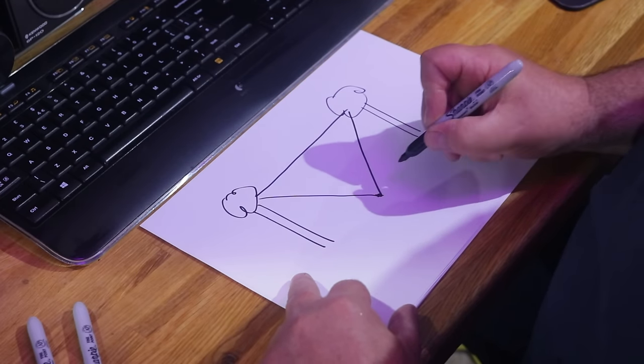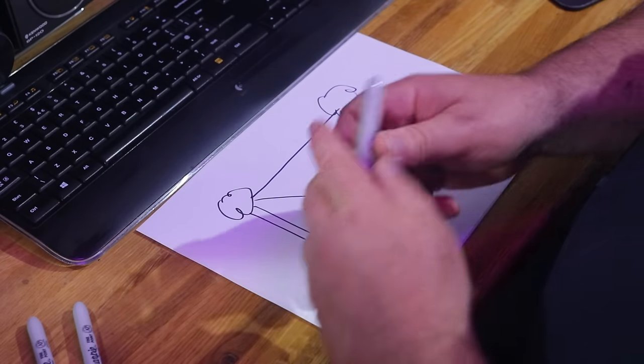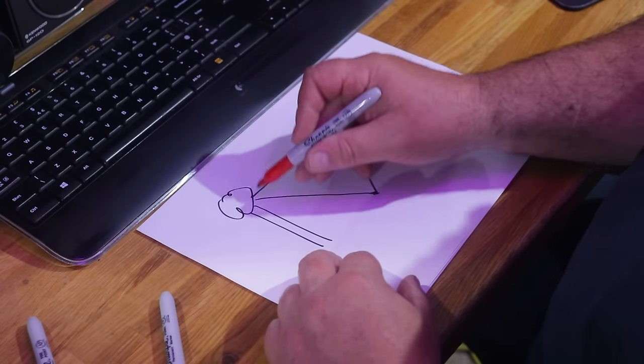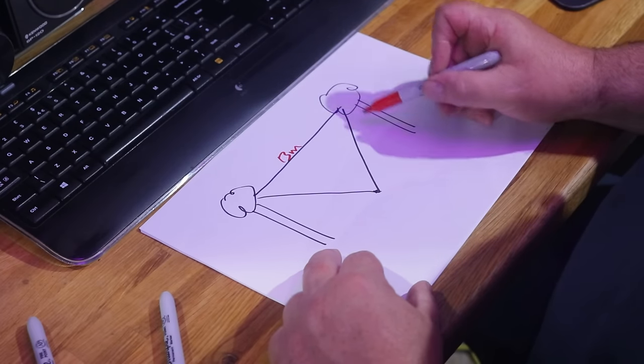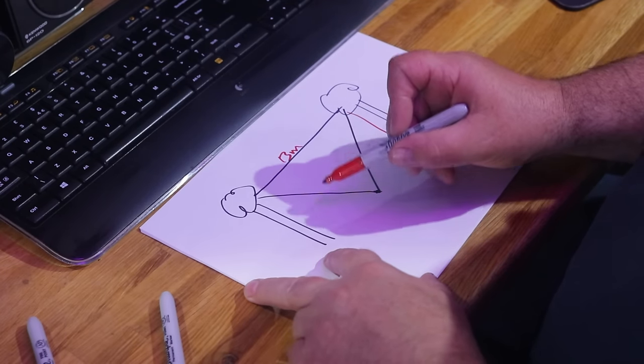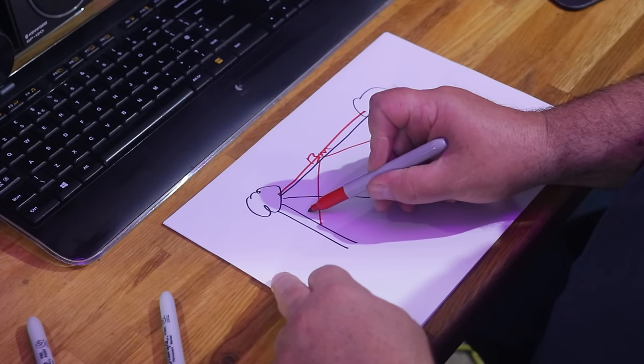If you've got two trees you could string a Delta Loop up this way and feed it at the bottom corner. You get a little bit of height off the ground. Similar problems apply — it's not a direct coax connect. You'll need some sort of transformer, normally a 4:1. But honestly, if that's 13 meters between the trees you need a pretty high tree — about 40 feet. You could just put an inverted-V dipole or a fan dipole in instead. It just seems a bit of a waste of effort.